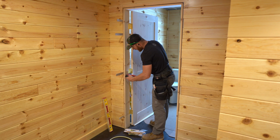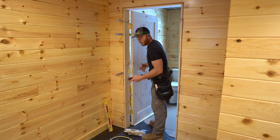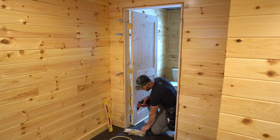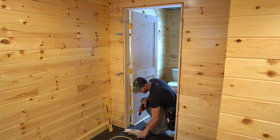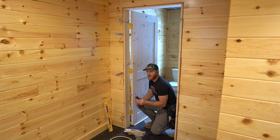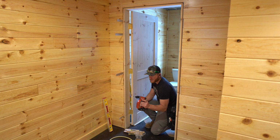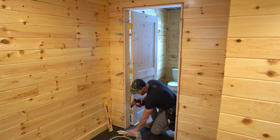And specifically for tasks like this, I don't want an impact drill. I don't want it to impact in, because you risk stripping out a fastener a lot easier with an impact. And when I say strip out, I don't mean the actual head, because impacts are usually a lot better at not stripping the heads, but actually stripping out the wood material. So you can set the clutch on this so that it just goes in and snugs it tight and doesn't over tighten it.